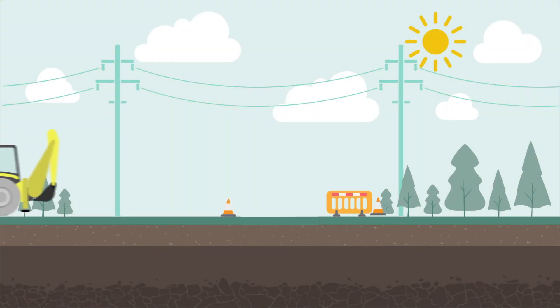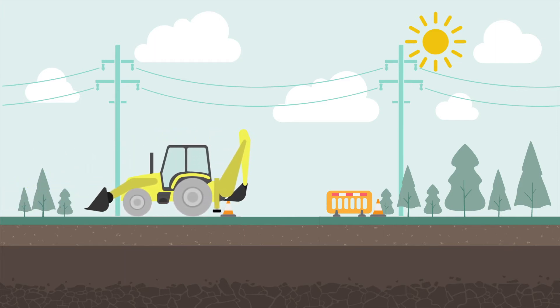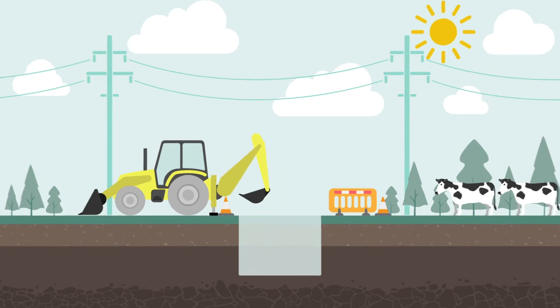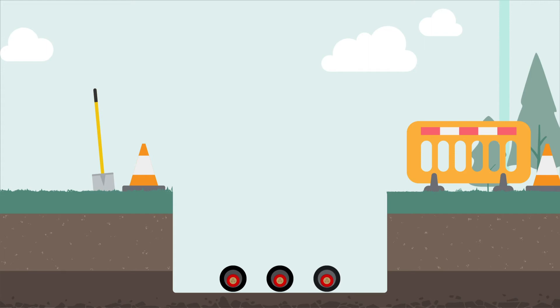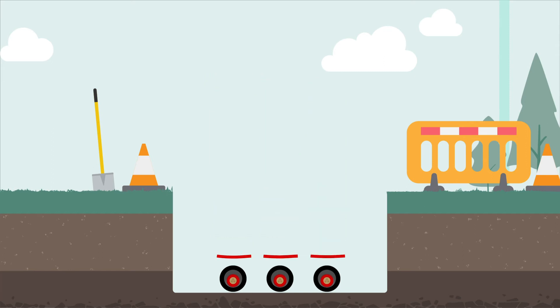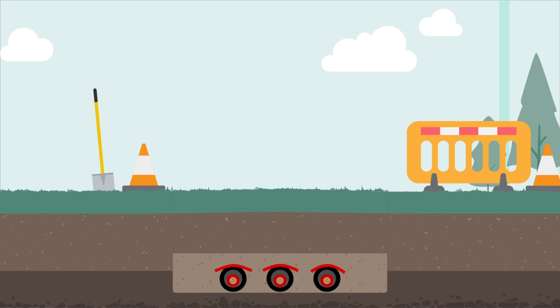If you opted to carry out the excavation works on your land, you need to ensure that the trench is the correct depth, as it will vary according to the service route, or deeper depending on the surface type. For example, it will need to be deeper if laid in agricultural land — our quote will advise. If ducting is required, it must be black electricity duct. Lay electricity warning tape along the length of the cable or duct for mains and services. We can provide ducting and tape as part of your connections quote. Cover over with stone dust bedding before backfilling the trench. Please refer to your connections quote for your site's requirements.